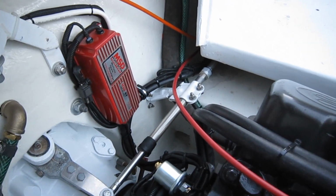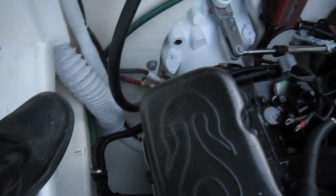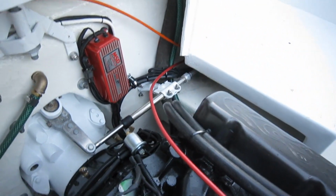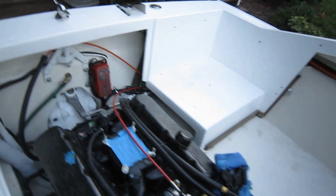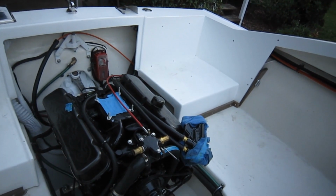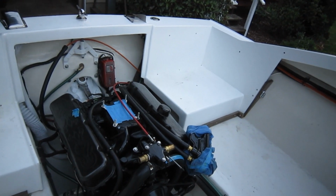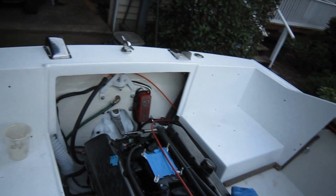It wouldn't be that hard to take apart, honestly. You just pull that ground bolt, pull your starter stuff off, and then you'd have to unplug your senders pretty much, and then you're done. I mean, you can push it right up against the transom if you had to. Not that I'm wishing anything on this thing. Hopefully this thing will last 100 years and you won't have to worry about stuff like that. But there's been many a times I've been taking motors out and I thought to myself, man, I wish somebody would have just left a half inch extra on that wire, or another quarter inch here, or whatever.